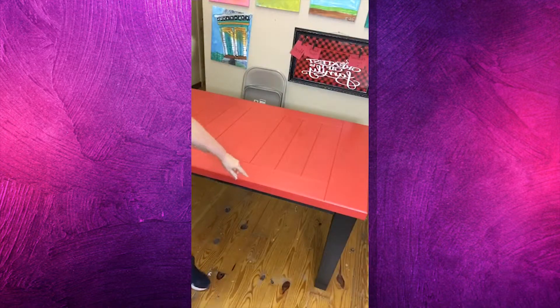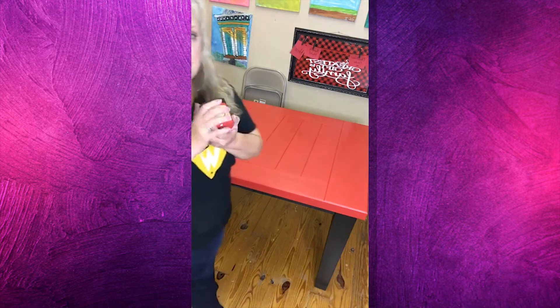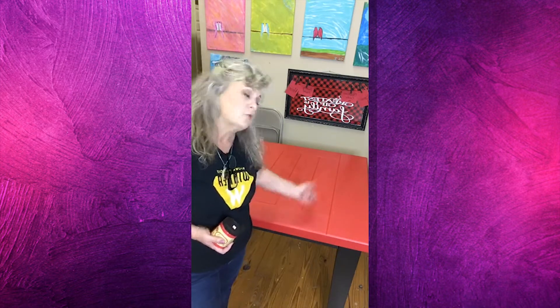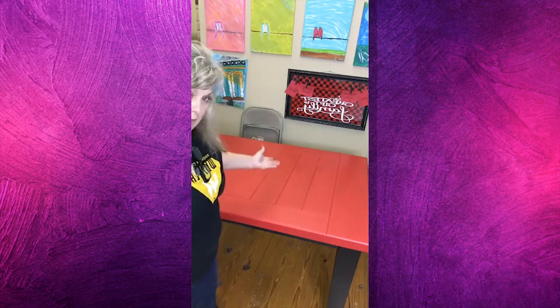The top I did in Dixie Belle Honky Tonk Red — how could I forget that? I did the top, going in all these crevices, and so far it has one coat of matte top coat and two coats of paint. Even though Dixie Belle has an acrylic base along with the mineral paint and doesn't need a top coat, when you're thinking about a dinner table surface — something people are going to be sliding stuff back and forth on, chunking their silverware down, putting a 20-pound turkey in the middle of — they go through a lot. Whoever this ends up belonging to — may end up being me, because I'm kind of liking it, even though I don't like red.